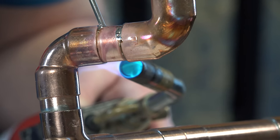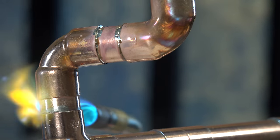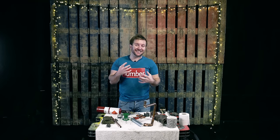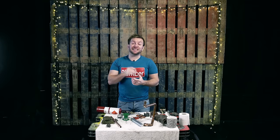What we're talking about here is the sort of solder you'd do on this fitting here if it was upright. We're gonna show you the coupling way, which is the easiest way to get over this problem, but also I'm gonna show you the hardest kind of way, which is the elbow way, where you can't feed in at the top as well.